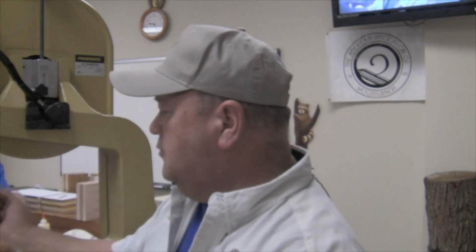The one that has a single part on the top, I went to that one because I'm not going to use that saw for resawing. I have the Delta that's a 14-inch, and I put the smaller blades on. I usually have like a 1/4 inch or 3/16 inch blade, and I can use that for making really sharp turns. So I use that on here.